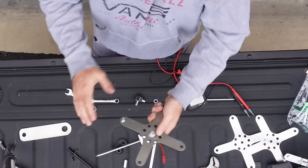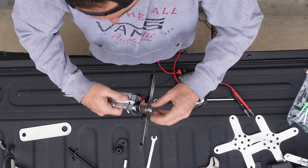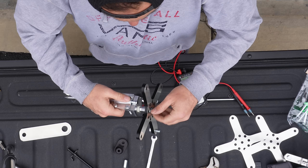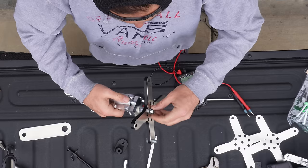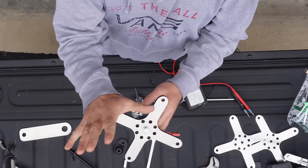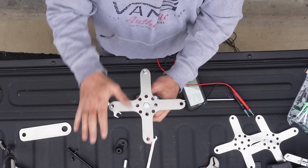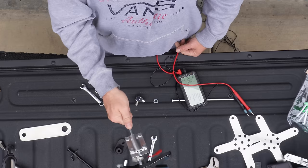If you wanted to take it a step further, you could put that Hamstick Commander top on here — look at this, it's kind of cool. A lot of people made good suggestions about strengthening the plate so the multi-band vertical has more support, and I actually have those parts in fabrication. In a prior episode I couldn't get all four antennas to properly tune — impedance values got thrown off. Five-and-a-half-inch spacing is still too close, so we're only doing two antennas right now.